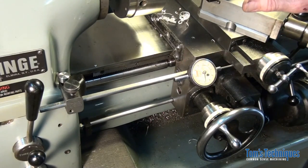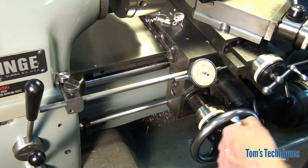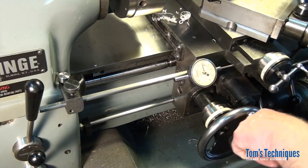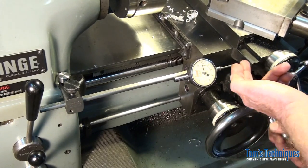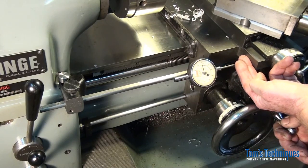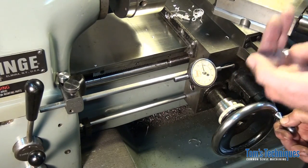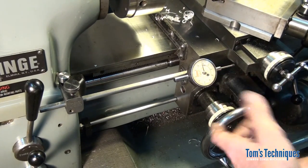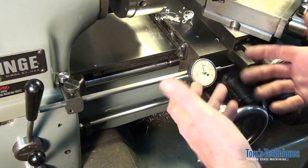It's similar in this respect to a micrometer carriage stop, but here's one thing the dial can do: you can go in as far as you need to, up to an inch with this indicator. If you have to go farther than an inch, you can use a gauge block — zero it out with, say, a one-inch gauge block in between, then when you remove the gauge block and move your tool, it's going to move one inch plus whatever you read on the dial. You can extend the range that way.